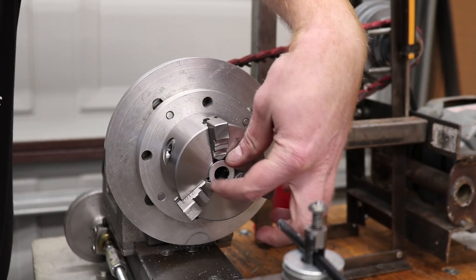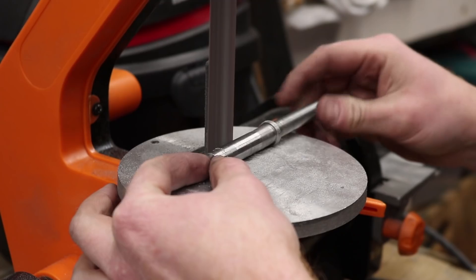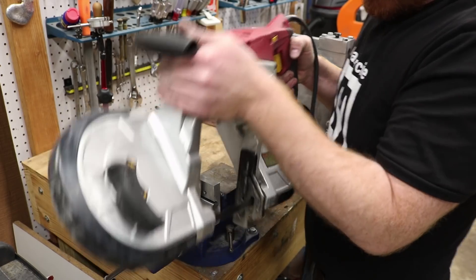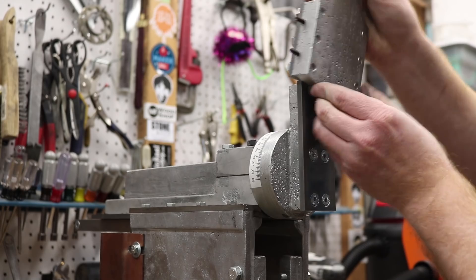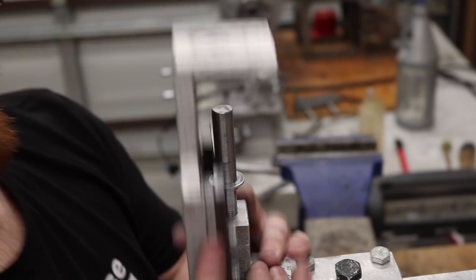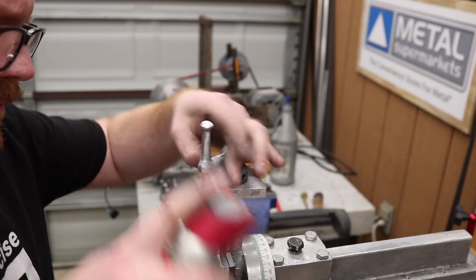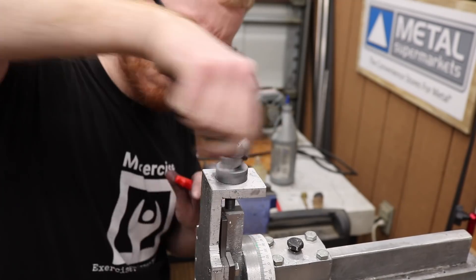This washer is called for in the book to provide a bearing surface where the screw mates with the downfeed flange. To give a little bit more clearance for the ball screw, I cleaned up the half-inch portion of the downfeed screw on the belt sander. With the washer in place, I was able to mark the other end of the downfeed screw and cut it to length as well. With the downfeed screw completed, I returned the downfeed to the shaper and installed it and played around with the fit. I used a file to enlarge the hole on the downfeed just a little bit, and I scraped the downfeed flange a little bit as well as using some WD-40 to help lubricate the system. After playing with it a little while, I felt like it really had a pretty good fit.